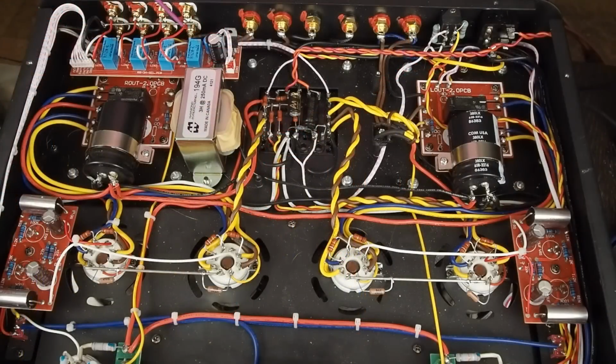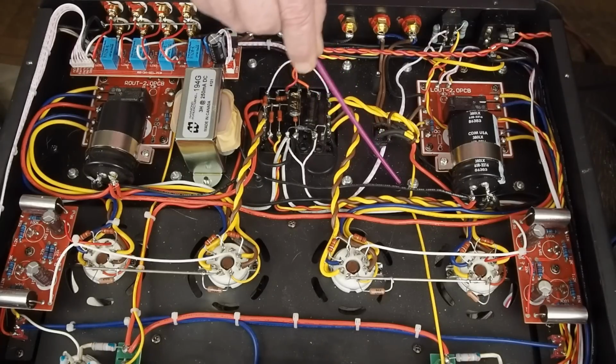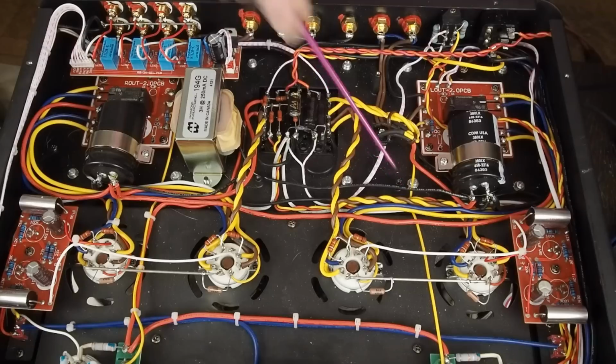Okay, so we got the power supply all finished. We got 2 new 550 volt caps. We got these upgraded with some nicer caps, replaced all these resistors, rewired the power with twisted pairs of wires. We moved the bridge rectifier up here, twisted these wires, and freed up this spot here to potentially use as a star ground point for future rewiring, and replaced this choke.